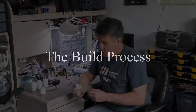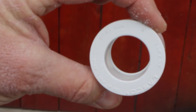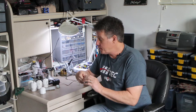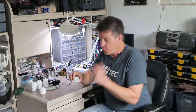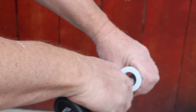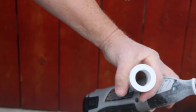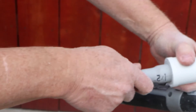The build process starts by taking your three quarter inch bushing and removing the little rim that is inside the pipe. I usually start by taking a one inch spade bit in my drill press and quickly running through that — it takes out the majority of that rim. Then I clean it up with a sanding drum in my Dremel tool, finish taking out that rim, and enlarge it just a little bit so that your piece of PVC will now slide smoothly down through it.